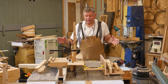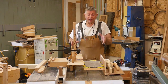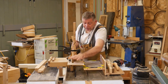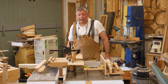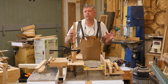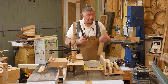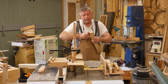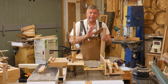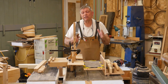It's not just accurate — lots are accurate. It's fast. It's quick to set up, which many are not. And it's totally guarded: the blade is totally enclosed, guarded at the front, back, and side. It works with a spacer, so you can do tenons of any thickness whether you work in inches or millimetres. If this spacer fits this mortise, then my tenon is going to fit the mortise, because it comes out exactly the same size as the spacer. The jig itself takes into account the thickness of the blade.